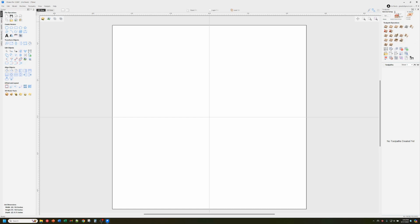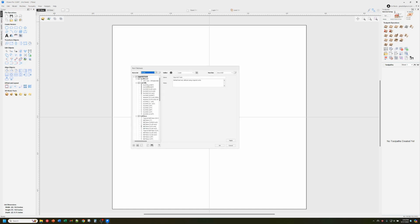So we're going to go into Toolpaths and to the tool database here, and I've already created it, but I put it under specialist, laser engraving here. But just to show you how you would create a new one, if I want it to show up under specialist, I would hit the plus button here, and that'll give you this first half of the tool up top. It's blank, and I'm going to say engraving bit. So that sets up what style of bit this is.